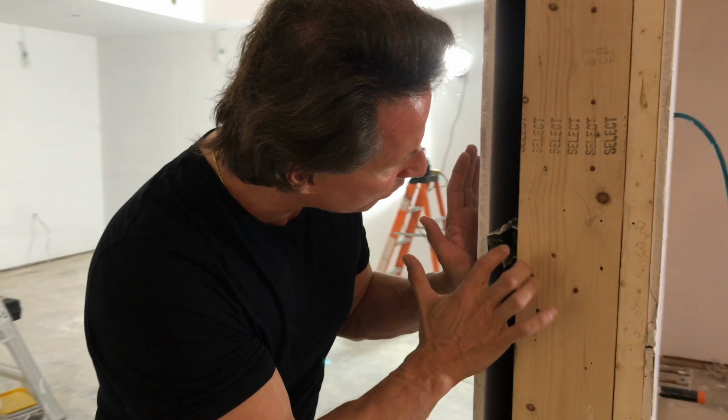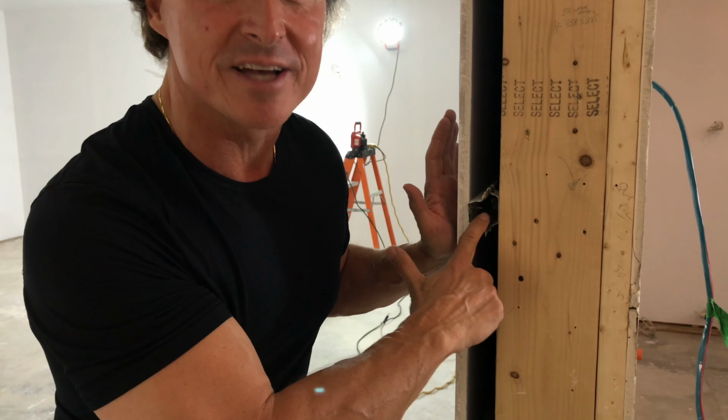On top of the framed wall, I have what are known as isolation clips. And what's cool about these isolation clips are this. When you're sitting there watching like a Star Wars or a war movie and bombs and grenades are going off, all this sound is banging into the wall and all the absorption comes into these clips and it stops right here. It does not vibrate through the wall, it stops at this point.